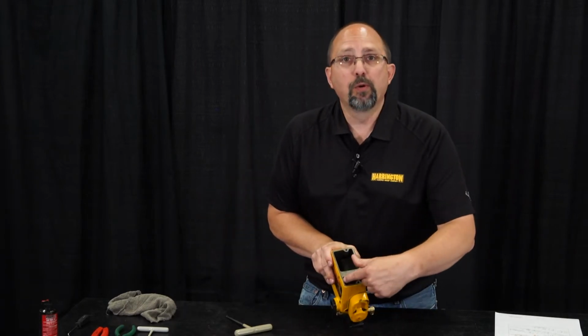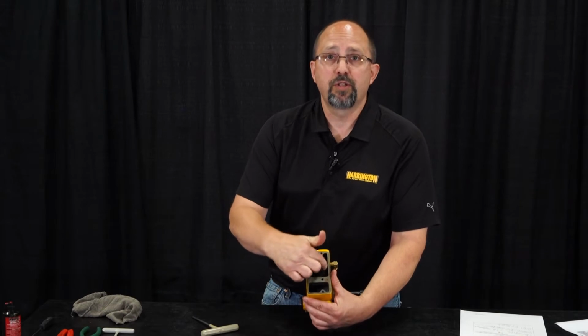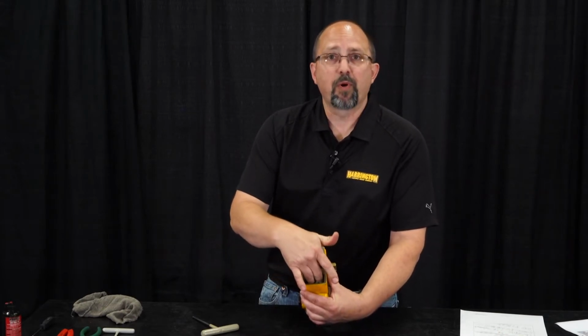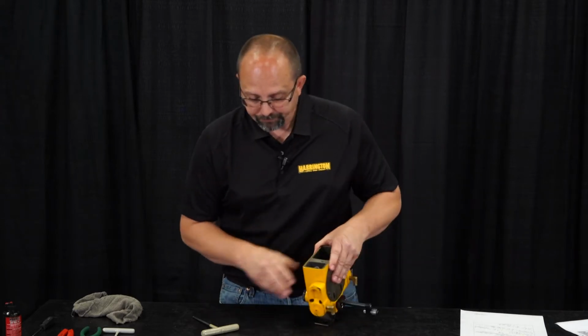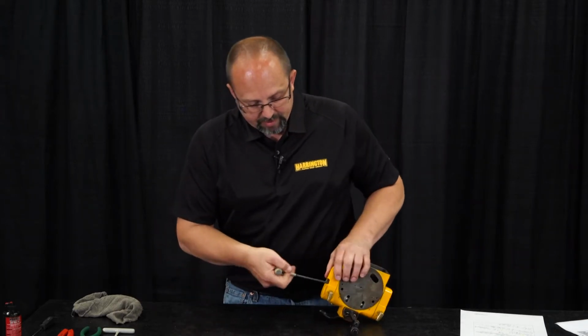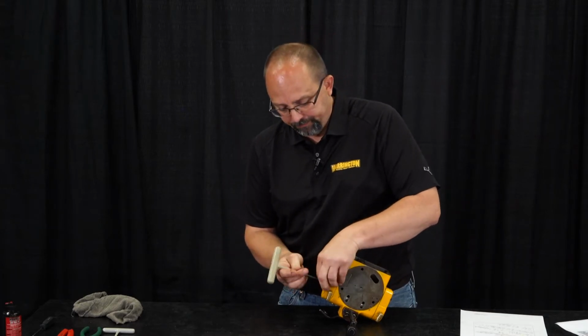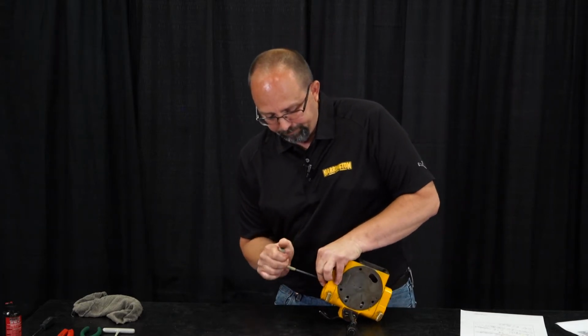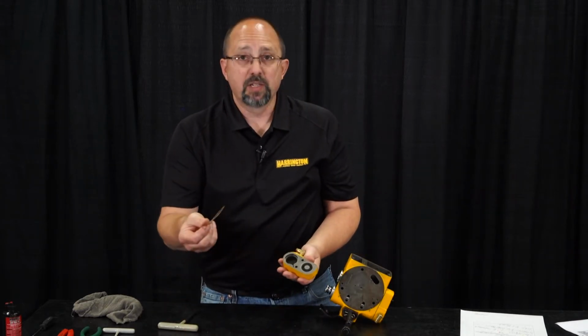This is the overload limiter chamber I was talking about. So our exhaust comes out this chamber right here. This is where the back pressure from the motor fills to move the brake spool over. Let's take these side plates off, and then we can see the spool valves inside. So there's the right side plate and its packing.